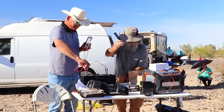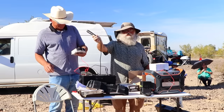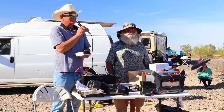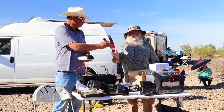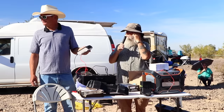Since these are clamps, I'm just going to clamp it on. This is a modified sine wave inverter — an Energizer 500-watt. I'm now ready to run something. Thirty seconds realistically, and I'm ready to plug something in and run it up to 500 watts. I could bring my drill out right now and it would run.